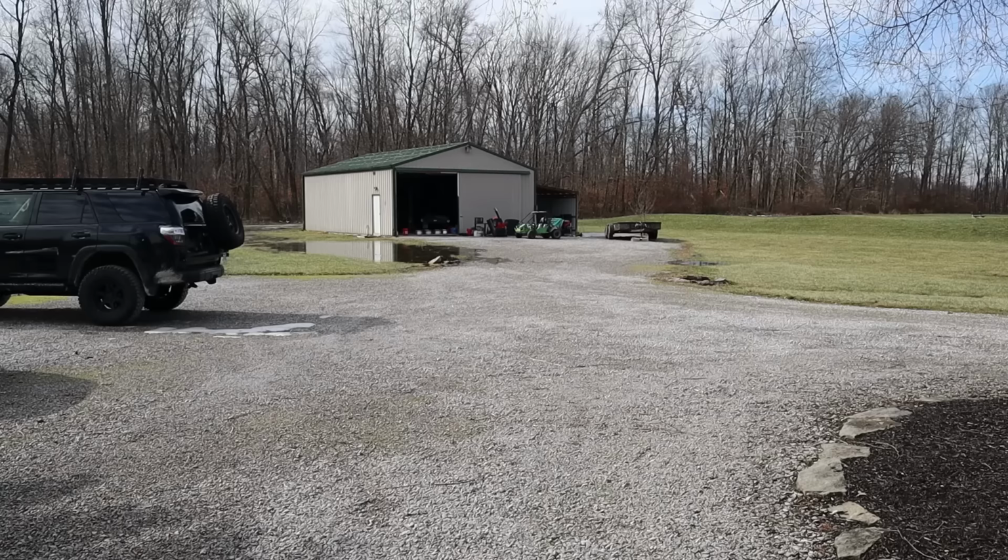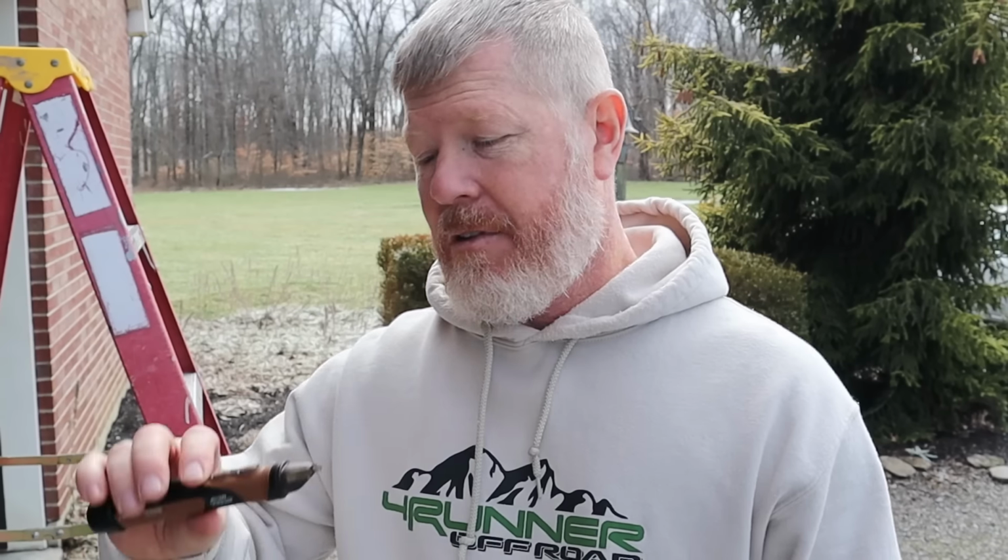And this is the area that we're hoping to do a much better job of illuminating at night or picking up any type of motion that comes through. Now I've killed the power from the fuse panel for the garage. I'm going to go ahead and work on taking the old one off. If you don't have one of these cool voltage detector pens, highly recommend that you have one in the toolbox. This will make sure that I have no power at the old light before I completely disconnect the wiring on it.